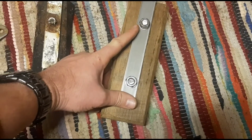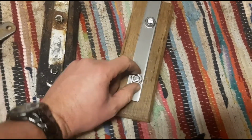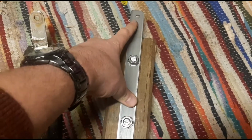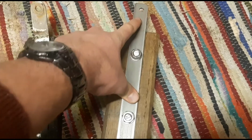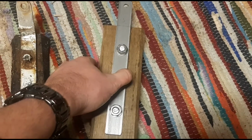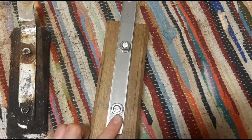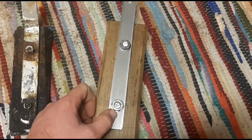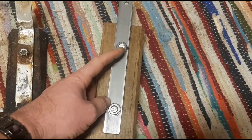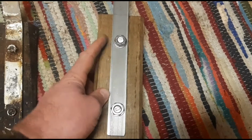So you could say maybe drill that to 11mm instead of 10. That would give you some extra play, but I have just literally bored out a 10mm hole and then just moved the drill about a bit. It's a little bit crass, but the main thing with drilling holes in these chain plates is to try and keep the heat down, because you don't want to compromise any of the other metal. So I've been doing it really slowly, which has been a bit painstaking and time consuming, but use some drilling fluid to try and keep the heat down, and don't drill high speed. If you're using a home drill, don't go full whack, because you will just burn your drill out. The stainless will literally just heat up and you'll just end up melting your tool end. So if you go half speed, nice and slow, you will cut through this reasonably easily. So yeah, that's kind of it really.